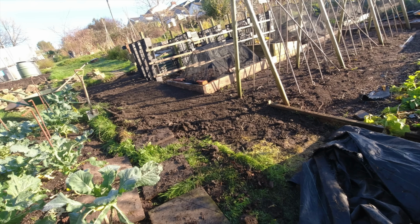I've just got to find myself another, I think, two or three pavers, which I think I've got. It's not as neat as it could be at the top. Getting that gradient right is difficult. I'll probably pull that up at some time in the future, add a little bit more in just to even the camber up. But otherwise, it's gone in pretty well. Right, the last stretch.